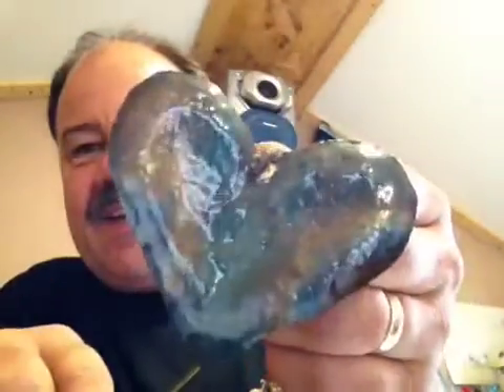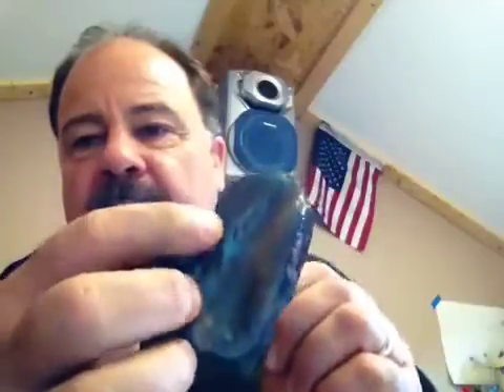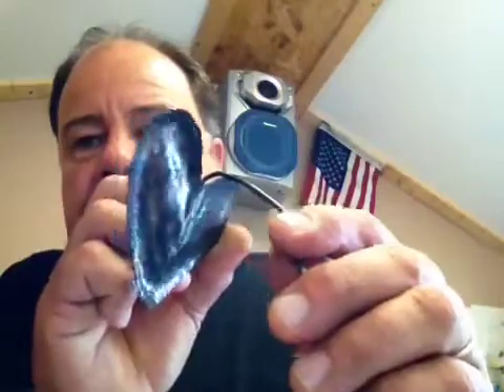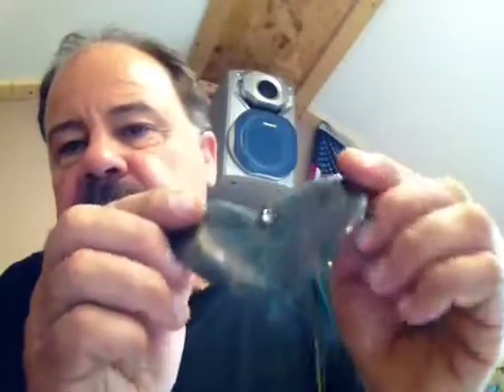Another type of leaf that I like to make — it's a little easier. My wife calls them heart leaves. This one I actually brazed on the coat hanger, but I've actually gone now to welding them on — it's just quicker and easier. These leaves are actually heat colored by heat and then clear coated. You cut them out in a shape and you hammer them until you get the shape you want.